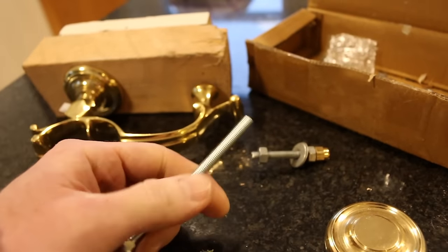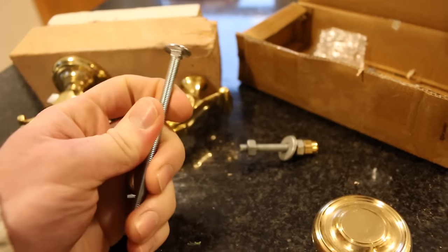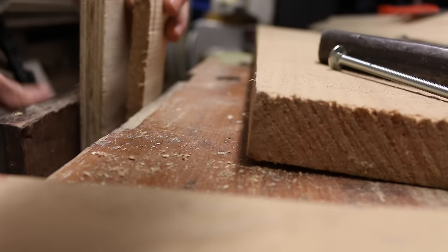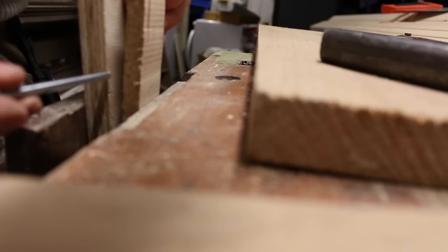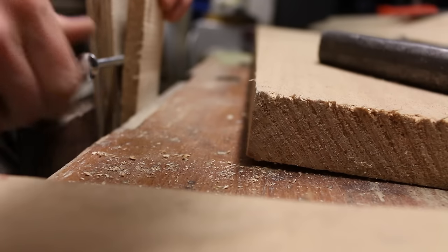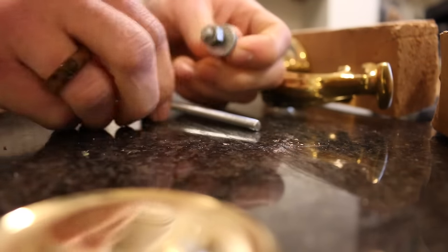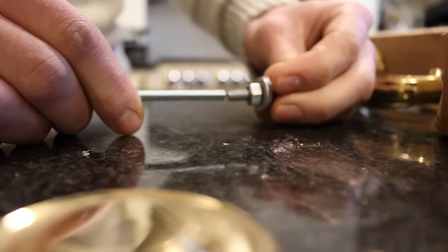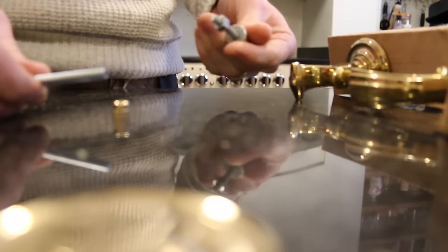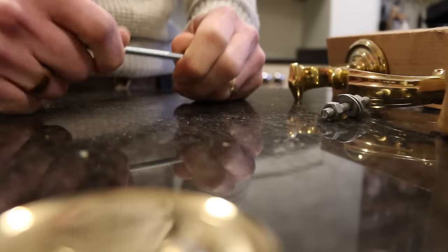The closest I can find is a 6mm bolt and it's still not quite matching up — it bites into the nut but won't go all the way on, so if I cut it to the right length it should just about work. I must get myself a little metalworking vise because I can't really do it in this woodworking vise without damaging it. Let's try sandwiching it in here. They are pretty much the same width; it's just the spacing of the threads which is different — this one may be an older imperial size. Anyway, it's holding tight, going on about two or three threads.